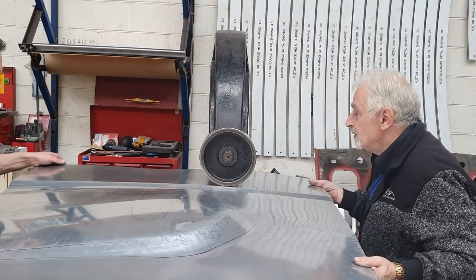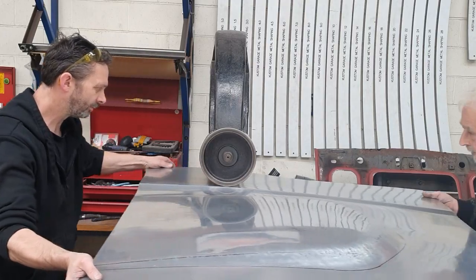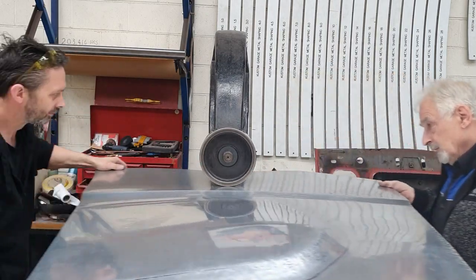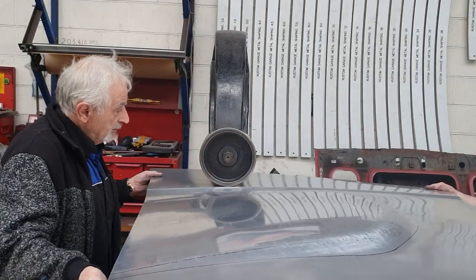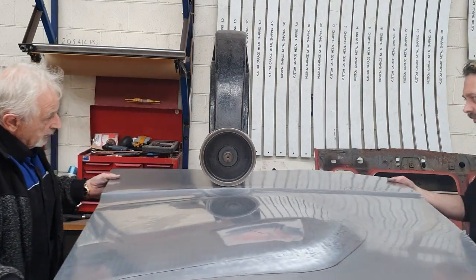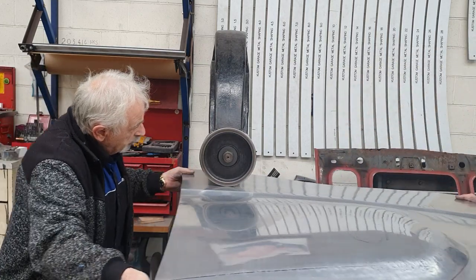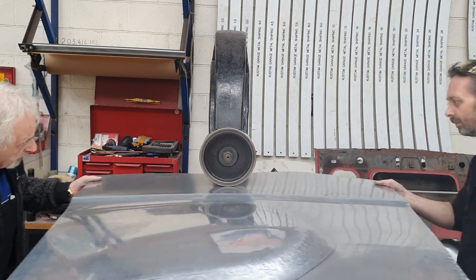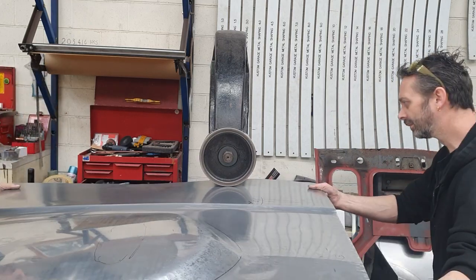We're working upside down just trying to control this line and get this area right. Wheeling through the entire panel just to even it up — the edge there needs a little bit of work, it's a little bit loose. Still working that edge near the swage line, trying to get it up. Filling the panel in the centre, working our way slowly across the sheet. There's a little bit of metal missing in the middle — we want to bring that area up. We're about to switch over to the sandbag.